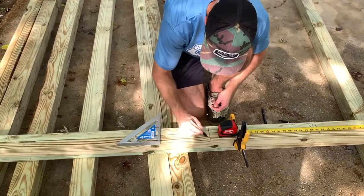As I mentioned in the field, you're gonna mark 1/2-inch from the top and bottom of each window and then mark 1/2-inch on each piece of trim. Then you're gonna install it in place as you're seeing on each side. I use screws, but you could use brad nails just as easily. You're gonna measure the distance 1/2-inch up and 1/2-inch from the bottom, cut the trim to size, and then mark the 1/2-inch. So here I am after field verifying the distance from both outside edges of trim, and I'm installing the bottom and top pieces there.